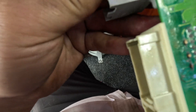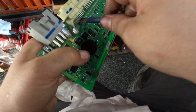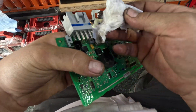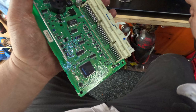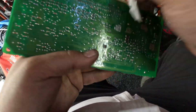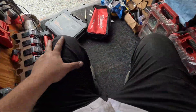The whole board is falling apart. Pins are tight but there's more corrosion over here. I think the board itself was shorting out the connector on the outside. Now that we've cleaned this up a little bit, let's see if we can get this thing started. If not, we'll order a new board. I can't tell if there's a trace that's bad — no, just the mask is peeling, so this is one trace. Let's plug this back in and see if we get anything different.